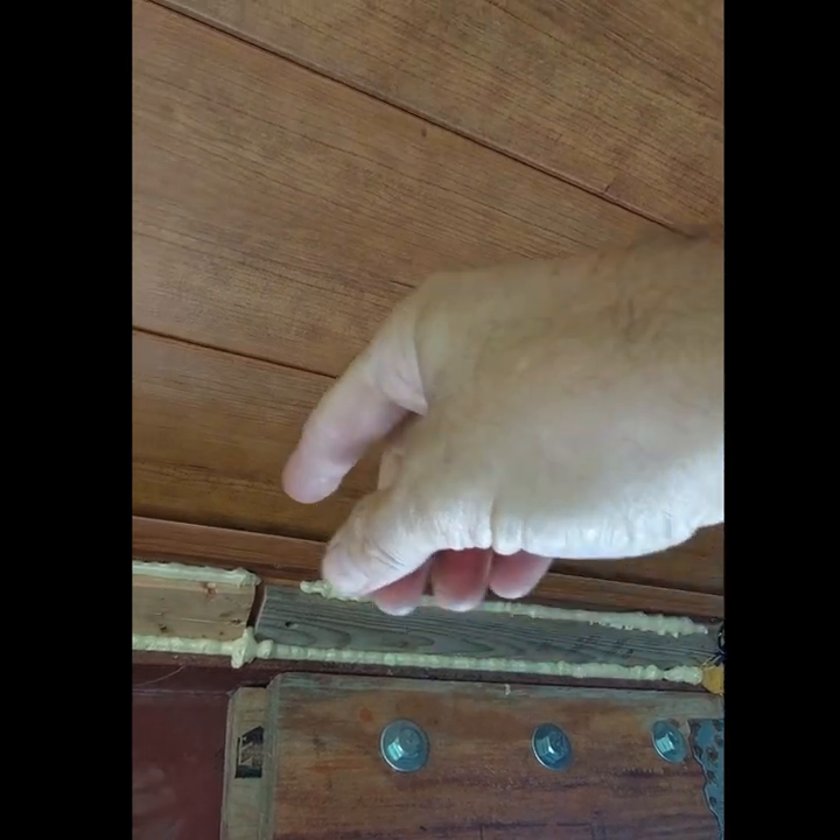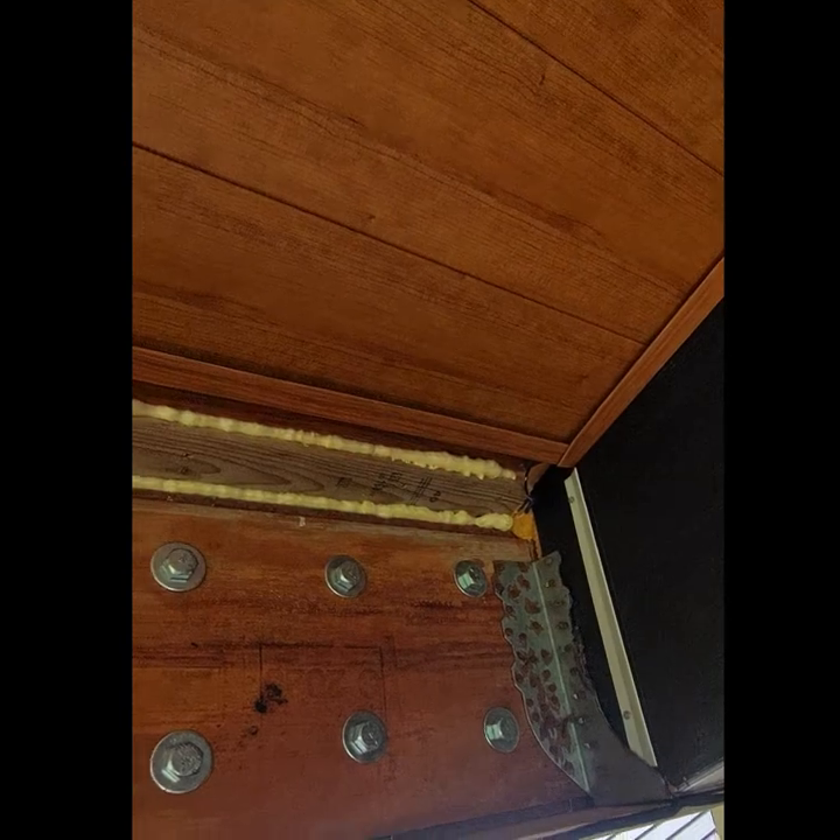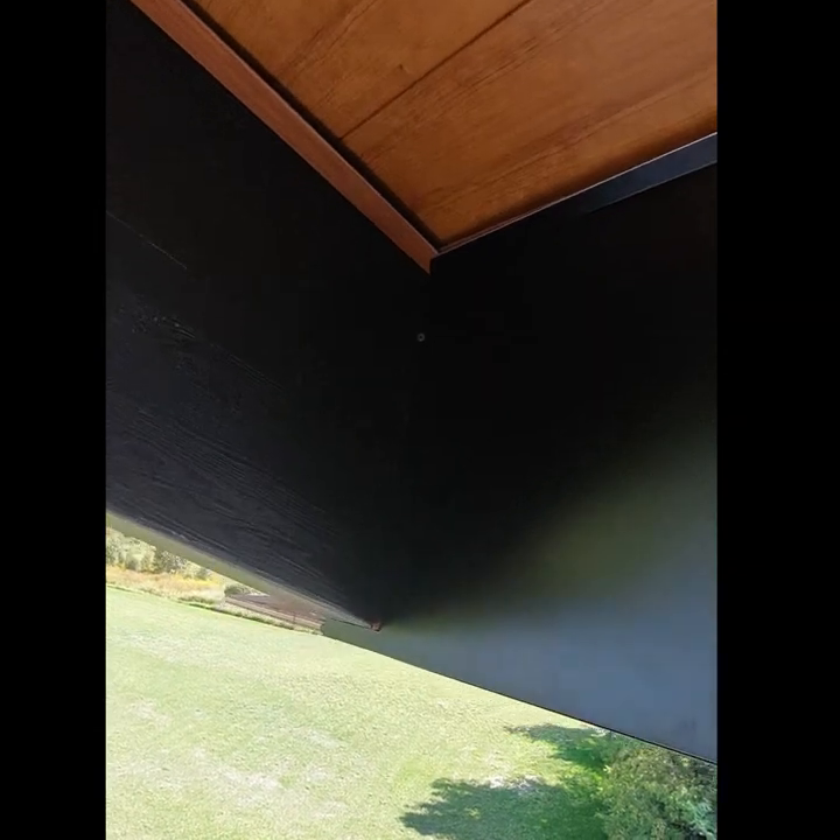At this point I'm not doing anything yet at the top because whenever I insert my fake wood reveal, I'll put two-way tape on that to hold the top in place. I'll add another fake trim on top to give me another straight line. To hide all the screws, I put a screw right in the joint — the caulking around it will hide that. I've also put a few brad nails here to hold the piece while the caulking dries, and the extra flashing piece will go up top.